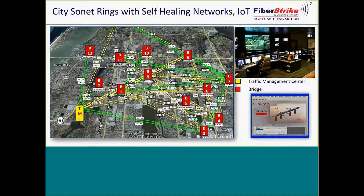Regarding the Internet of Things — we had the opportunity and were the very first people in the United States to utilize telecommunications already in place for a bridge in Alaska. You don't have to have any instrumentation on the bridge itself, which is very powerful. When you can do a multitude of bridges with only sensors on those bridges and use a smart switch that's IP addressable, then that wavelength from these sensors can be transmitted back to a traffic management control center. In Alaska, the weather was so severe they did not want engineers having to access bridges to reboot a PC — it can all be done in an environmentally controlled environment.